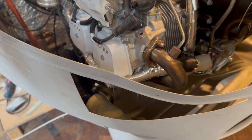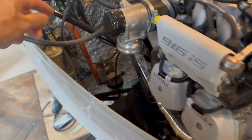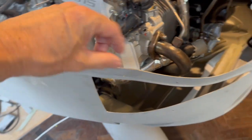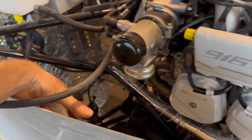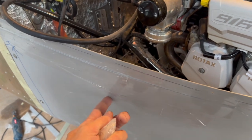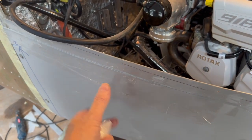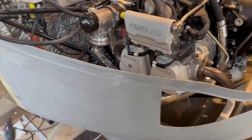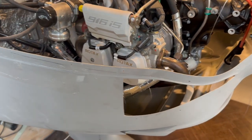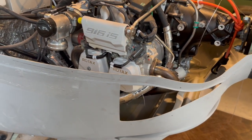And it makes more sense because I did wonder how it was going to go at the back, how you'd get the intercooler off. So it seems a bit odd to me that you'd just cam lock it here and then the whole thing is, you know, it's got a lot of leverage up this end. I don't know that that's ideal. I might have to stick another cam lock sort of back here or something just to take some of the weight. But anyhow, that's interesting, something a little bit different. So that's something I'll have to deal with. Have to get some more cam lock fasteners in order to do that.